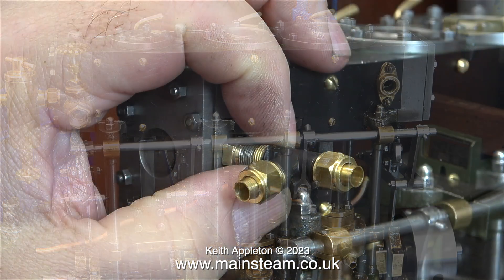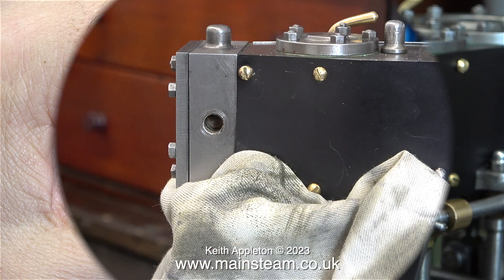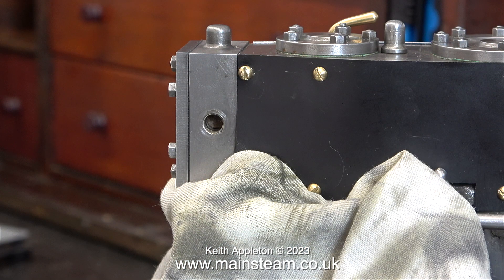This is the part where I was figuring out how to mount things. I'd initially made an adapter which went into the steam chest. This adapter was quarter by 40 threads per inch to screw into the steam chest and 5/16 by 32 at the other end to connect the airline.